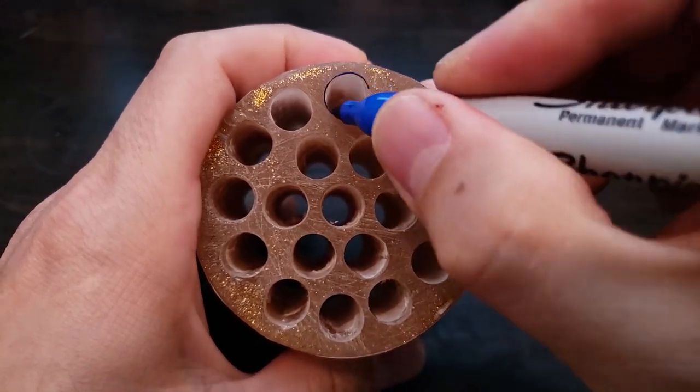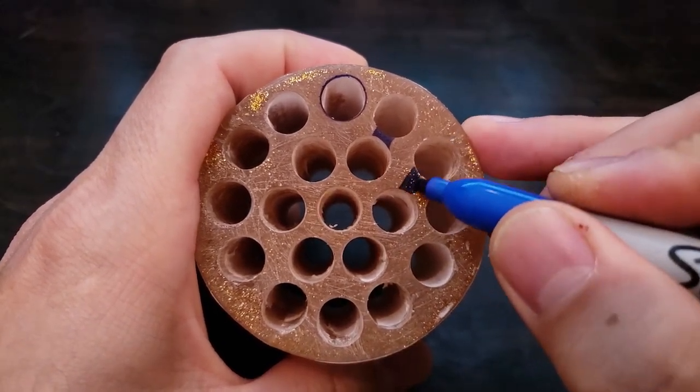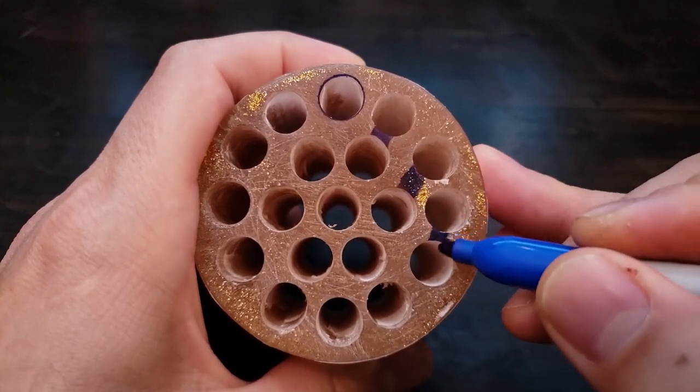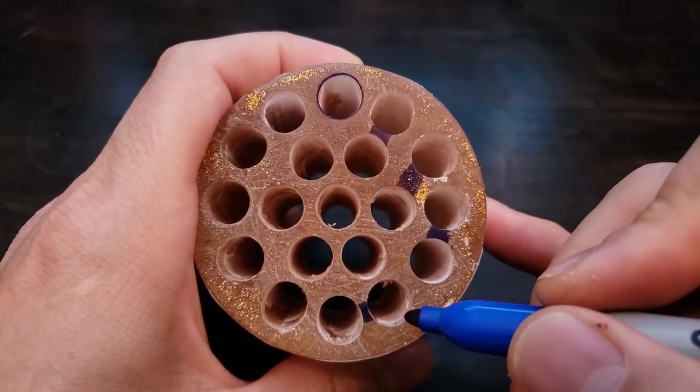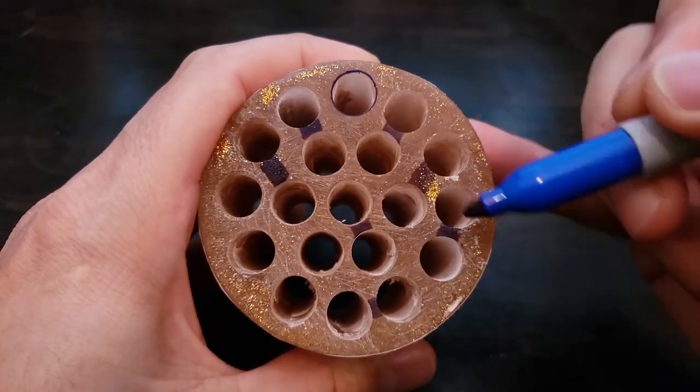So this is what I thought was actually the fun part. The labyrinth works by sending sound waves through a maze of tunnels. After closing the top and bottom, sound will only enter through one hole on the top and exit through another hole on the bottom side. All the other holes make up one long twisted tunnel. Without the labyrinth, the sound would likely bounce to the backside of the ribbon creating phase issues.